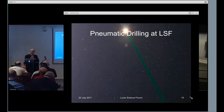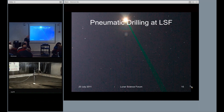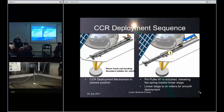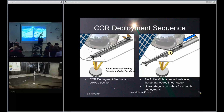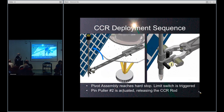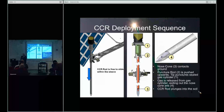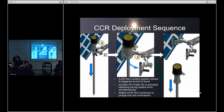The next question is how do we do this on the lunar surface? To address that, Chris has been working with the astro-robotics people on what can be mounted on one of the Google X Prize landers, and this was the resulting design — it would be on the lander. The only mechanisms: a pin is pulled here and it slides out. As it gets to the end, a spring-loaded mechanism rises. A separate pin is pulled at the head, that drops it, and when it drops, the gas chamber is punctured and that starts the gas flowing. Then it is released and emplaced.